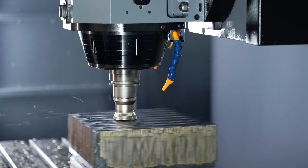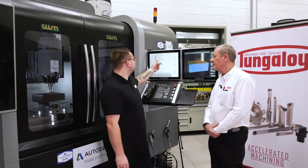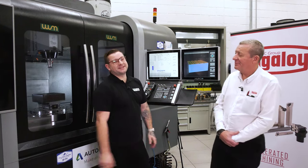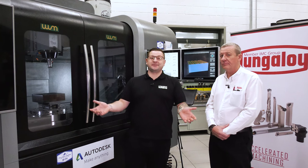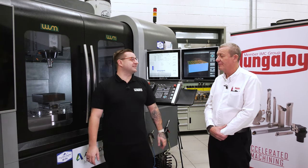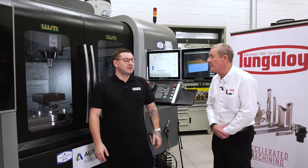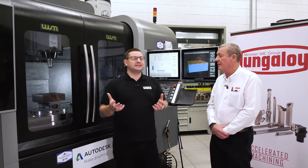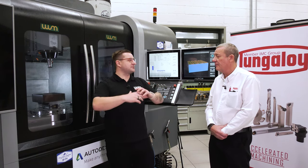We've been going about five minutes — well, two and a half minutes of actual cutting on a 250 mil block. I don't think there are many other ways you get that done faster. It's a serious metal removal rate on a relatively small spindle. Some people think high-feed cutters are only for your big top-end machines, but that's just not true.